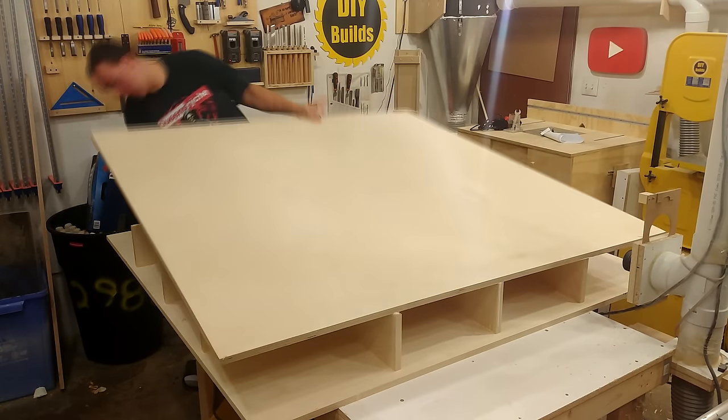For dust collection, I get a 4-inch PVC pipe and heat up one end to flatten it so it butts up nicely against the router. Clamping two pieces together gives a nice flat surface. The collar on the router sticks down about an inch lower than the mounting bracket, so the PVC pipe is one inch longer — I bring it over to the band saw and chop off the one side closest to the router to increase air flow. This PVC pipe will have the hose going in the top and the opening on the bottom to suck.